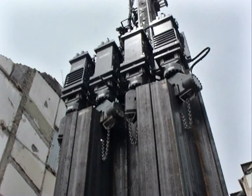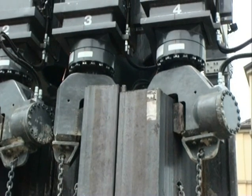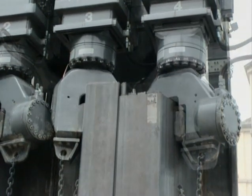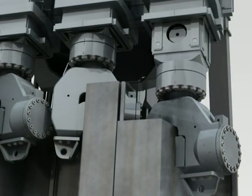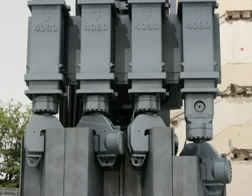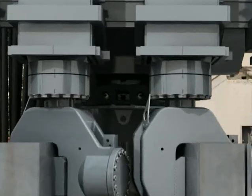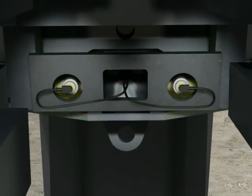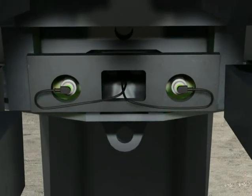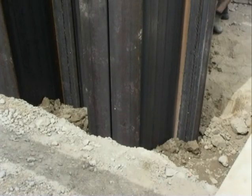Greasing of the interlock also helps to reduce interlock friction. Another special feature of the Liebherr BVB sheet pile presser is the system of torque monitoring. This system automatically stops the pressing process if the bending torques resulting from the pressing process exceed those which can be absorbed by the carrier machine, providing utmost safety for the carrier machine and the leader.